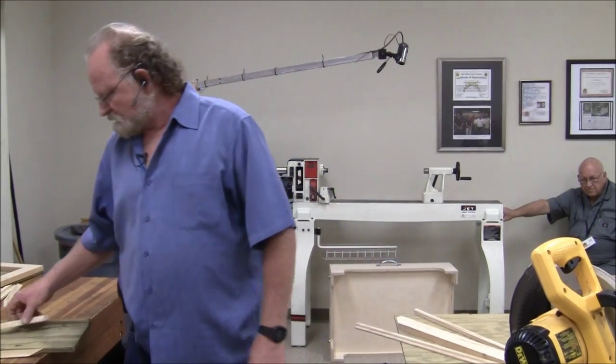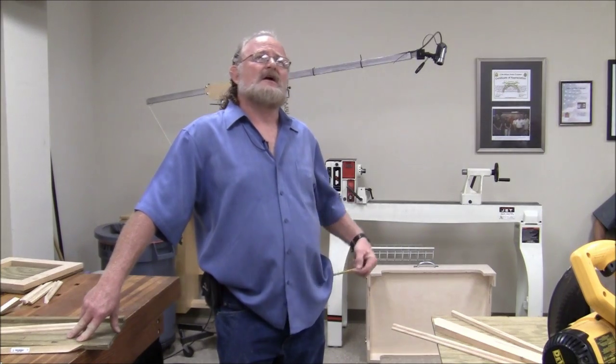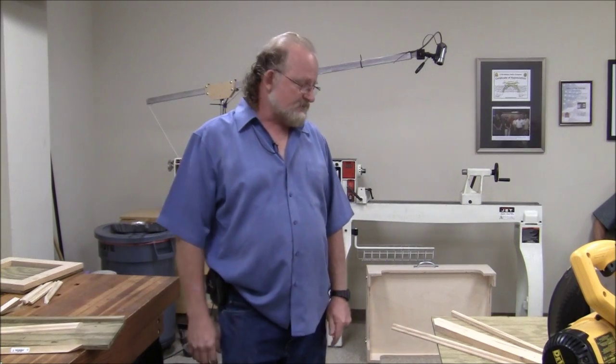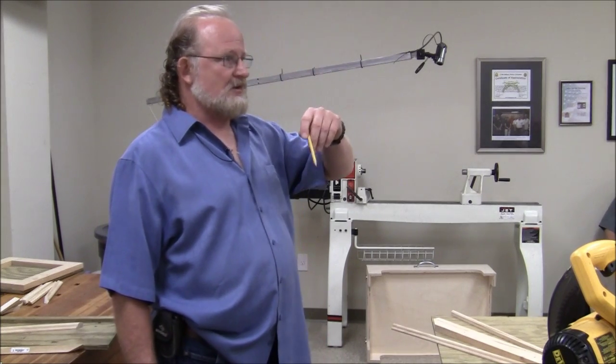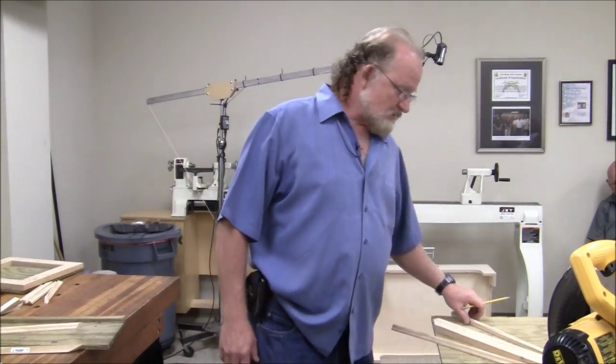What's your preferred wood filler for a nail hole? Whatever matches the species close — not necessarily what matches the species exactly, but if I know it's going to be stained I try to match the color to what it's going to look like when it's finished. Sometimes I'll use a redwood filler or a mahogany filler — I try to blend the color. I know where it's going to go. I like water-based filler a lot, though the problem is it just takes a little longer to set up. The floor finish people that sell flooring have water-based fillers that work out pretty good.